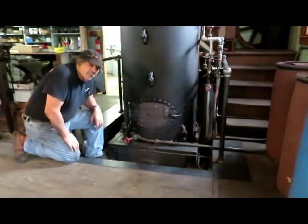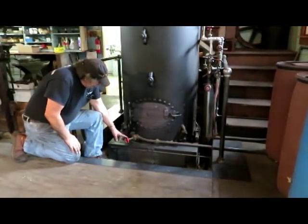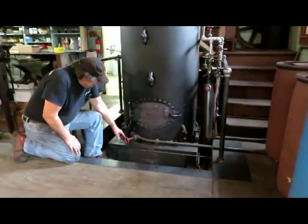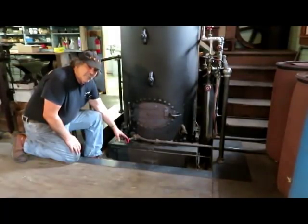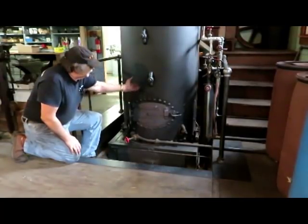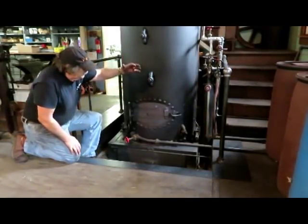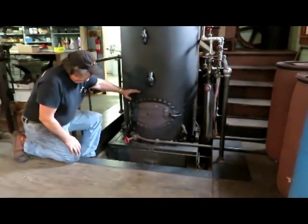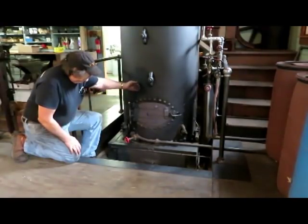Another point of interest here with boilers, this is called the blowdown valve. It's at the lowest point of the boiler, and it's typically a drain, but it's also used to minimize the amount of minerals and other bad stuff that concentrate in here. As the steam is being generated and the water is being used out of here, that stuff stays behind, and it concentrates so that it sometimes can form scale on the inside of the boiler shell and make it steam hard, and it's also dangerous